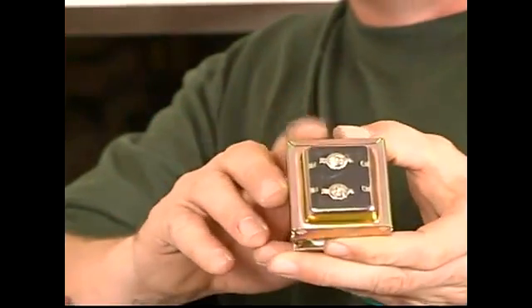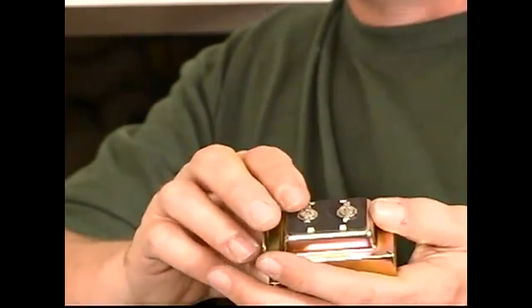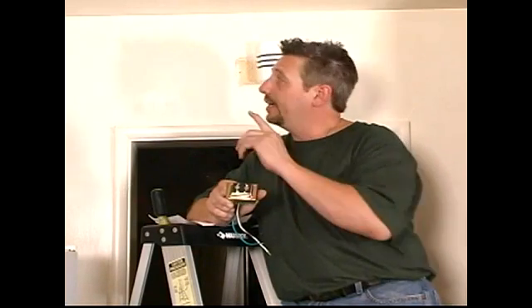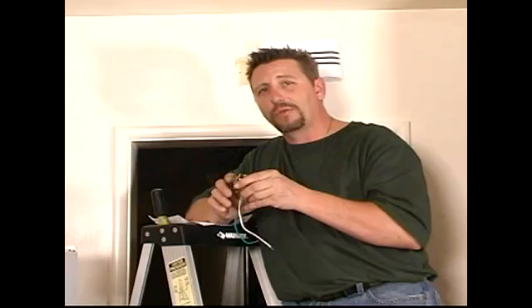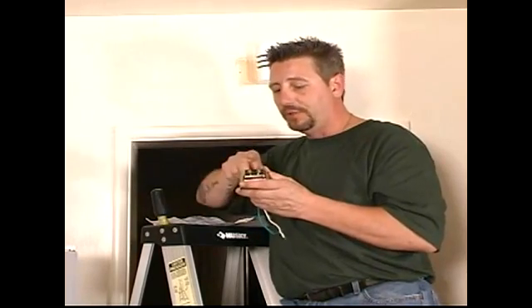On the other side of the transformer — the secondary side — one of the wires from the button at the front door goes to one side of the transformer, and from the other side it goes to the base. It's basically a switch, closing the circuit and activating the transformer to feed that unit. You take one lead from the front door and land it on one of the terminals. You take the second lead — the red wire from the base — and land it on the other terminal. Up in the attic you'll see three wires: one wire will go all the way through to here, and one wire will stop here.